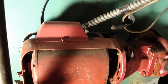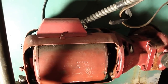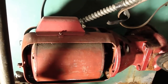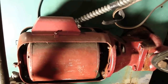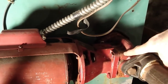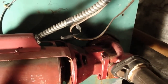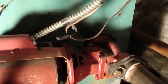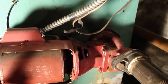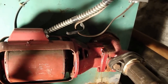I believe that the coupler and motor mount is broken or rusted — it's no longer properly turning the impeller inside this housing. That impeller is what circulates the water through the system, so without the impeller turning, the heat can't get through the whole system. The pump is necessary to run the hot water throughout the entire system.